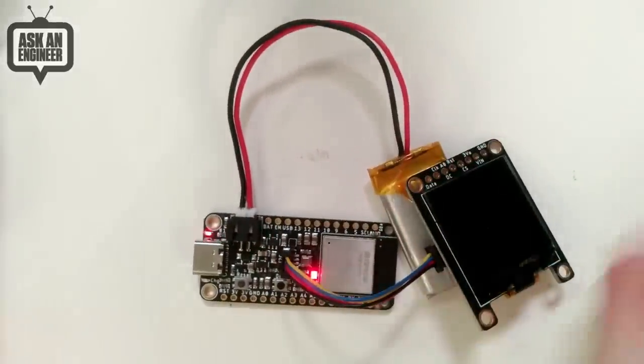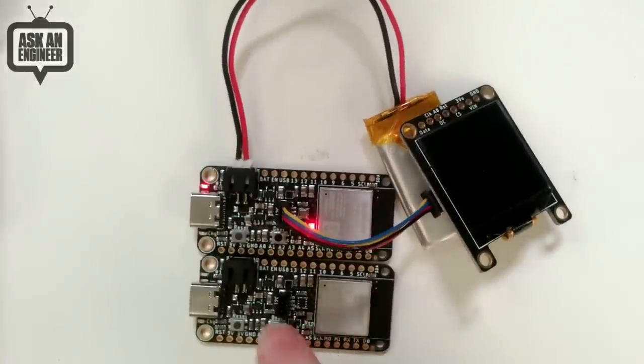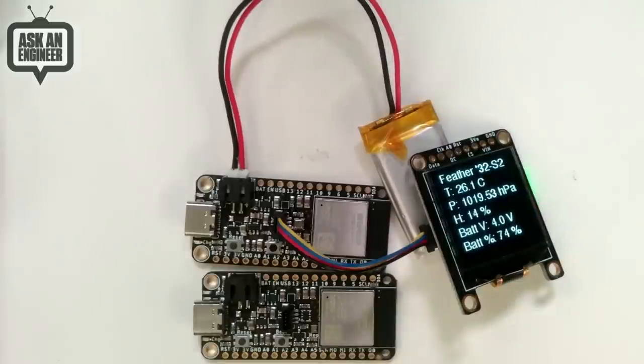Yeah. But I just really love the little mini version of the ESP32-S2 module because it means we had that extra space in the center for the optional sensor and STEMMA QT. Yeah. So check this out. We are going to be making tons of these. They're going to be really popular for sure. And we have a couple of variants also of the ESP32-S2 feather. But having the PSRAM is key, especially for CircuitPython. You really need that extra 2 megabytes to be able to read data from the internet, parse it, and do graphic stuff if you need to as well. So I think it's worth the wait. Test the product.